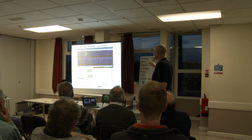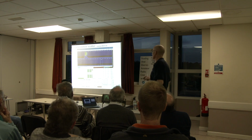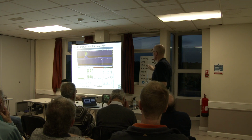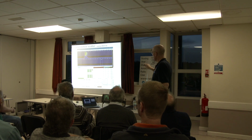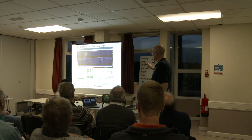So this is in a package called MSHV. Underneath it is still Joe Taylor's stuff, the coding software. This is a timeline of the signal strength, and you can see that here was a ping, and you've got a pan adapter and waterfall type of display. Out of that, you can see the timeline here, in seconds. So you've got a ping there that was about 1.5 to 2 seconds long.